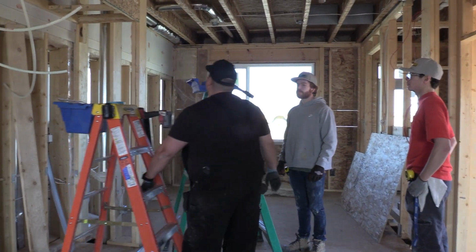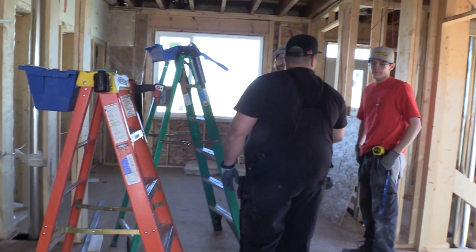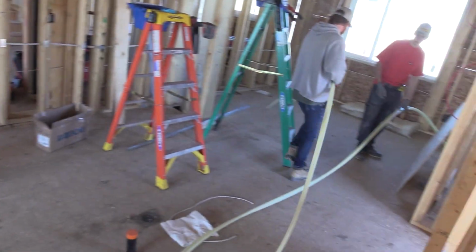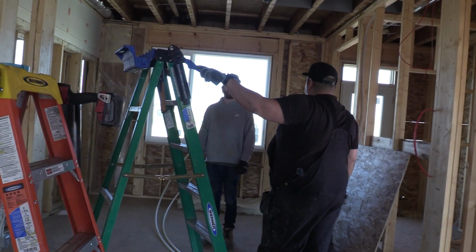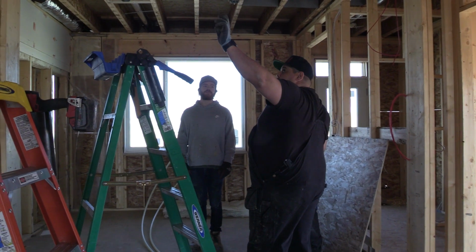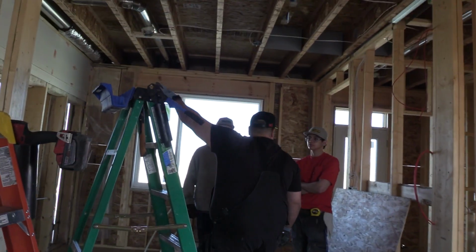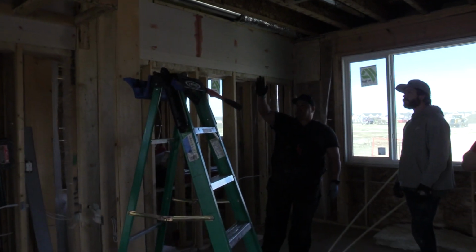All right, so first thing we're gonna need probably 2 lengths of 3/4 inch for each size. Okay. So let's grab 2 lengths of hot, 2 lengths of cold for 3/4. We're gonna need 2 3/4 half tees, one for the hot, one for the cold, for the end of this run here to feed the last 2 bathrooms, right? And we're gonna need 3/4 half tees to pick up the laundry and the bathrooms. And we might need 2 3/4 90s here and 2 3/4 90s maybe up in the joist if we decide to change.